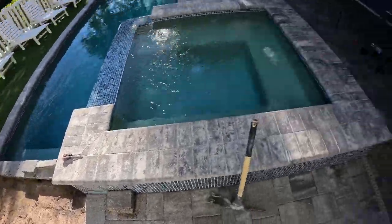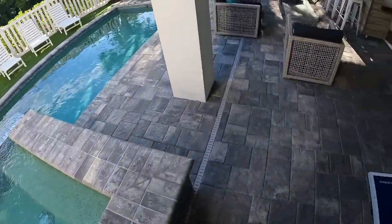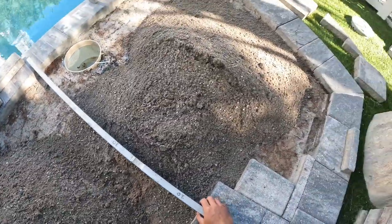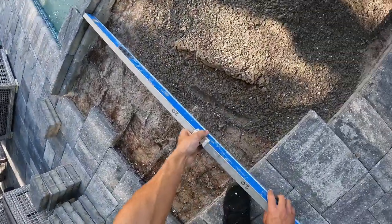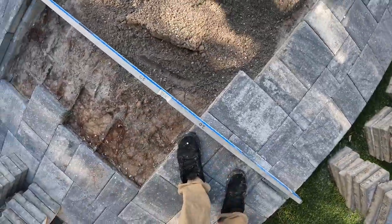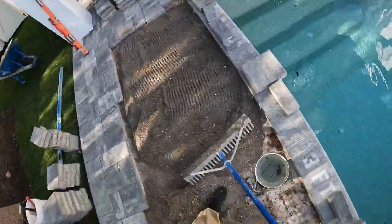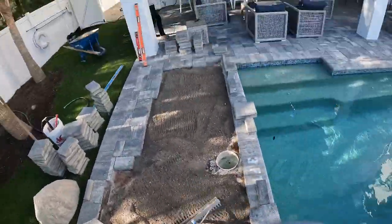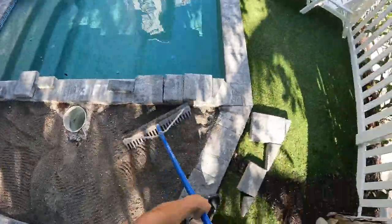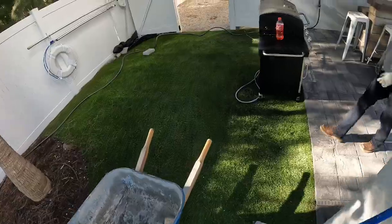Look at that nice little sinkhole. At this point I am raking out my sand, getting it ready to start compacting. You want to get it a little level — you don't want mounds right before you start compacting or else it'll be a pain to start screeding. I want to grab the actual compactor and run it on this so it actually sinks the sand down.